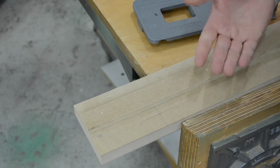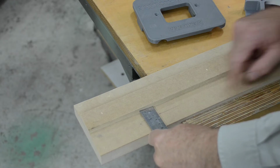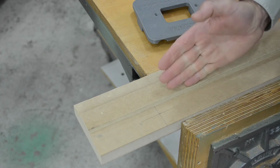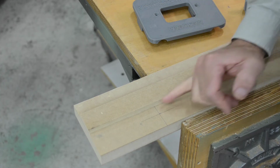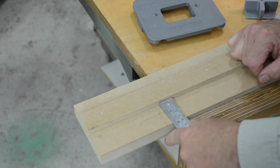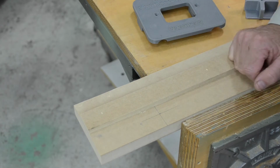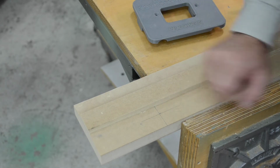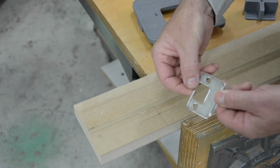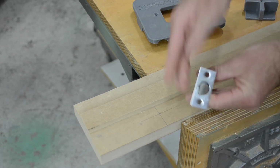Okay, so let's say your door is 38mm thick. You might set the center line to 20mm, so as to have 19 either side of that center line, plus a 1mm clearance, or whatever the imperial equivalent is for that. 38mm is 1.5 inches in the old currency, so work to whatever clearances you like. But basically, let's say that's your center point, which is the design center point of where the latch pin would be, which corresponds to dead center of the latch. So straight down the center, both ways.